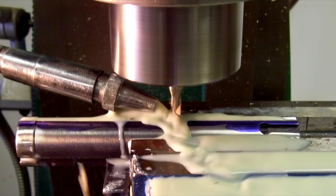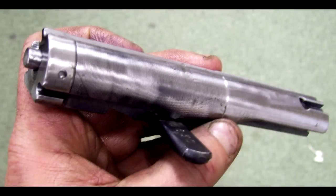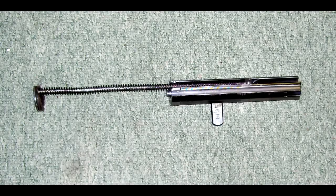Here we're machining the slot in the top of the bolt for that little rail to ride. You see the full length of that little machined-out rail on the top of the original bolt. And here's the entire bolt assembly complete. You'll notice in the rear back here we've got a firing pin extension, and I've cross-drilled and pinned a firing pin retaining pin in place. This is the bolt ready to go in the firearm now. For the original recoil mechanism, since the firing pin now runs the full length of the bolt instead of the original short fixed firing pin, I had to mill a slot so this will fit over the firing pin. And here you see the entire firing pin installed — the entire bolt assembly is all put together with the recoil spring.